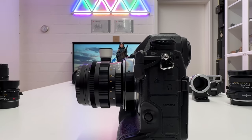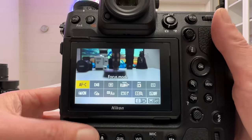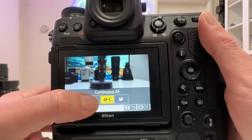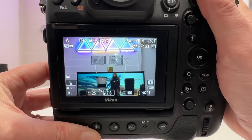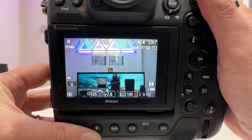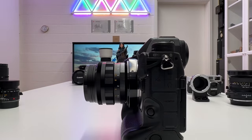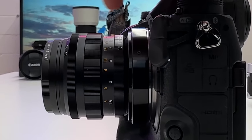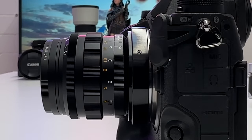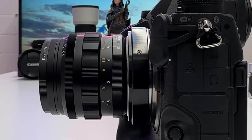To see the motors in action: I switch to autofocus single, focus on the TechArt adapter box in the background, then repoint the camera and watch the adapter drive the lens out via the motors to find focus. You can see the lens physically moving — and listen to the sound. That's the adapter doing the work; there is no electronic communication between lens and camera per se.